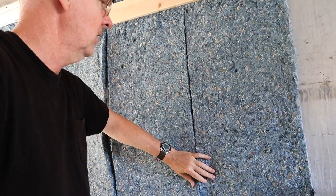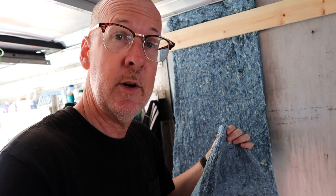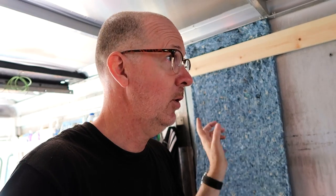I could probably put some tape in here to hold this together, but I really don't think it's going to be necessary. I sort of like working with this — I'm going to use it on the walls, and then once I get to do the ceilings I'm going to do those with poly iso. I would prefer denim, but poly iso is going to be easier to do the ceilings with adhesive, and because I'm sensitive to height I don't want to lose it. I want maximum R-value in the ceiling, whereas on the walls I don't mind going in about two to two-and-a-half inches on each side.